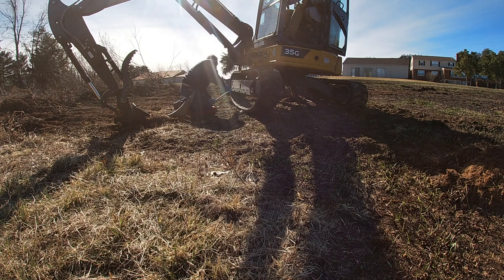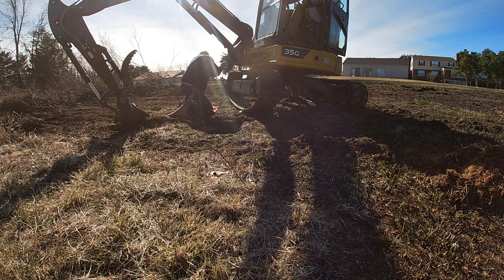Now I'm gonna move up to the front. I'm gonna get Cory to go the other direction. It slipped on me so I'm getting another bite - you can see I'm pulling that tread over and he's slowly moving it forward. I'm still working, getting a good bite on it, and this time I got it. He's slowly going forward and boom, it just fell right into track. It's that easy when you got two people doing it.